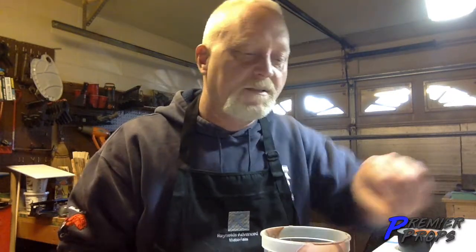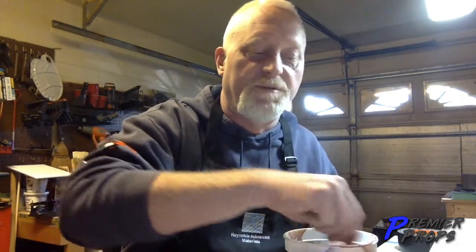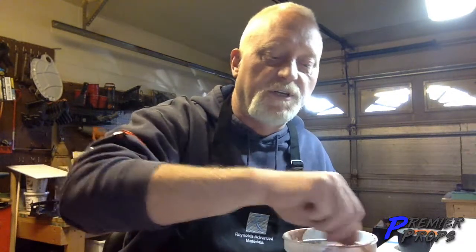A few things that I've learned through experimentation and trial and error is when you're dealing with this clay, once you nuke it up, it turns into a liquid. And you want to make sure that you mix it up. You don't want to have any big chunks still in there, so when you're pouring it, it splatters, and you've got to do some cleanup before you can work with your actual model and pour your silicone. So I give it a good stir.